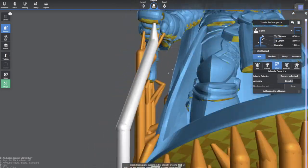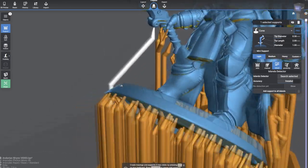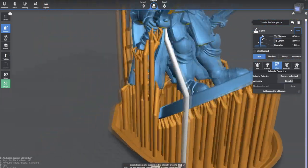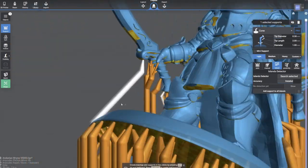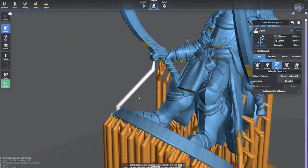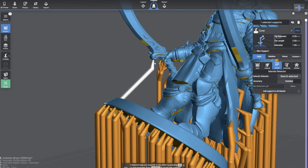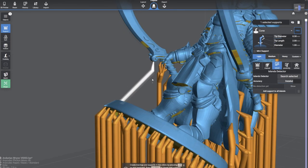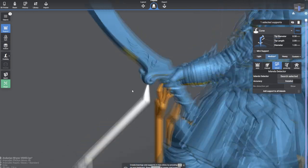Okay. Sometimes it'll do supports that protrude out like this, and surprisingly, they tend to print pretty well. So it's not a big concern to me, but if it needs to support a lot of extra weight, then that angle is going to make it hard and it's going to want to bend up and down and maybe cause the print to deform a little bit. So you might consider just increasing the diameter just a little bit.